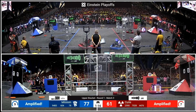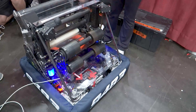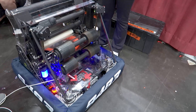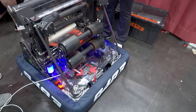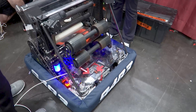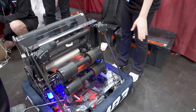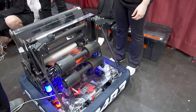Now heading over to Zilla — talk to me about your shooter. Our shooter is dead axle, aluminum tube, and uses Cat Tongue again like the intake. The shooter pivots so we can shoot wherever we want on the field — the angle and speed are controlled automatically. The highest shooting angle is about 65 degrees and the lowest is about 17 degrees, so we can essentially shoot from anywhere in the middle of the field.